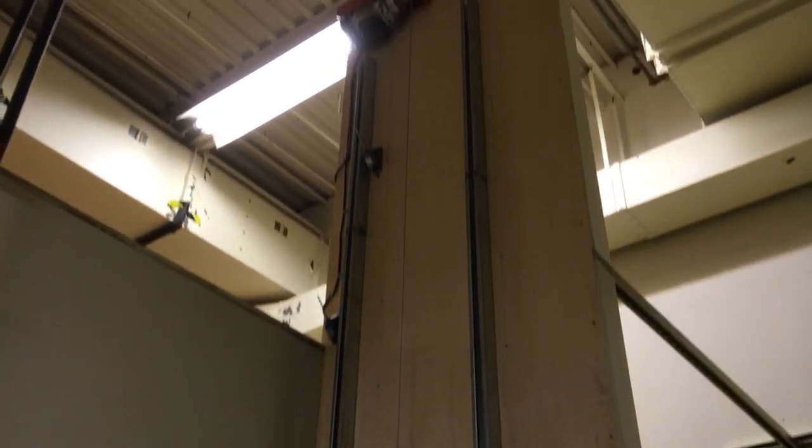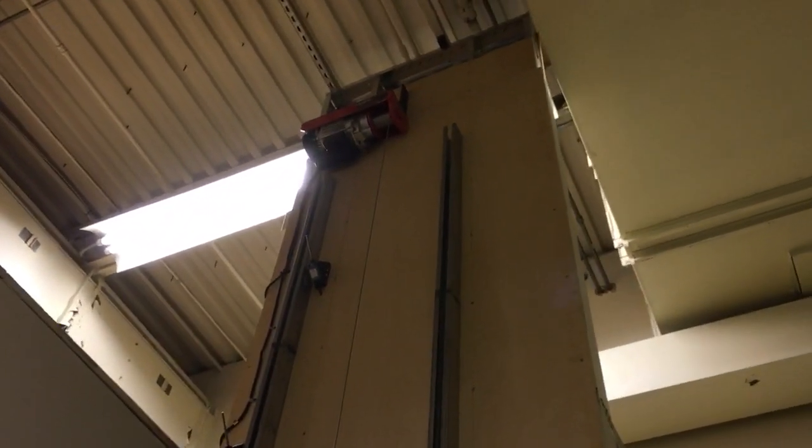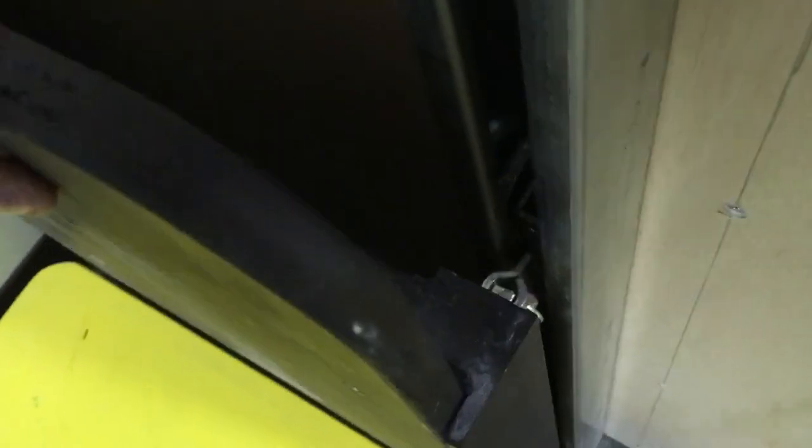You can see it goes up a track, up to the top, and it actually runs on a Harbor Freight hoist that pulls the rider. These are actually tracks used on a barn door, so they're kind of repurposed. What that allows is to hold the wheels, which you can kind of see in there on the track. There are four of those attached to a steel frame, and then that rides in there.